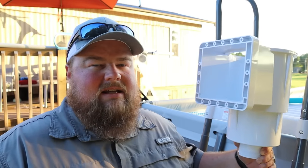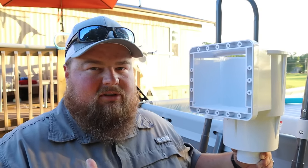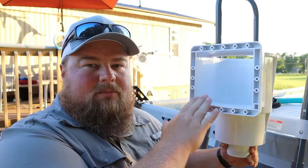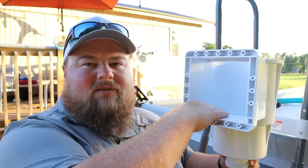If you're not familiar with what a skimmer is and you're wondering why in the world we're actually doing this — why are we buying this? A skimmer is a device that changes where your pool filter draws in the water to filter it, from below the surface at some little portholes to a box that can reside above and below the surface and get things off the top of the water. It kind of skims the top of the surface.